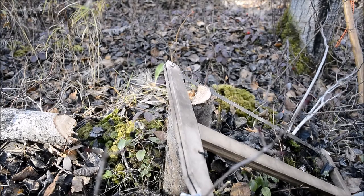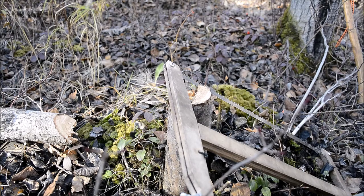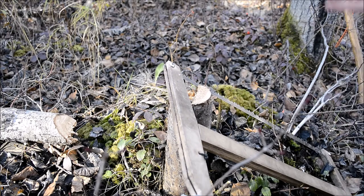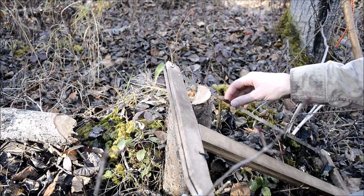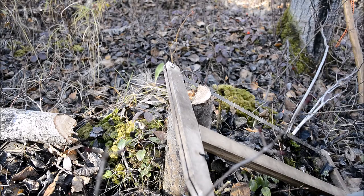With that noted, I want to go into how to set up the saw. Really, you don't have to do anything too special with the saw, just assemble it. If it's not assembled, do make sure, if you can, one of the big things when felling a tree with a bucking saw is, since there will be a lot of lateral torque on the blade, you will have to tighten it down more than when just bucking a piece of wood. The blade just has to be tight enough, but when actually felling a tree, since you're cutting across the tree, it actually has to be tightened down quite a bit more. So do keep in mind that, if at all possible, you will need to put as much tension as you can on your saw when felling trees because of that lateral torque.